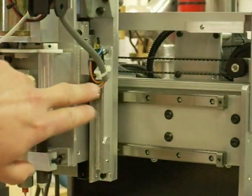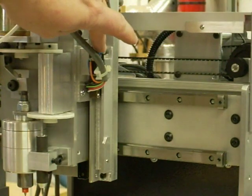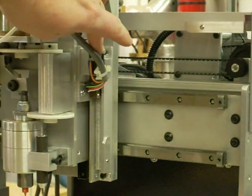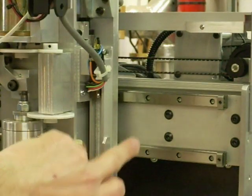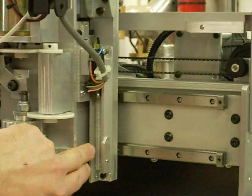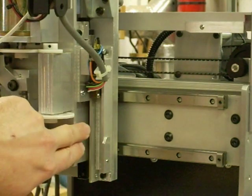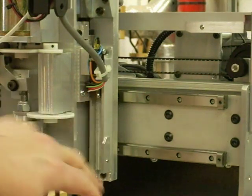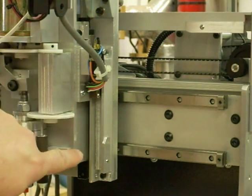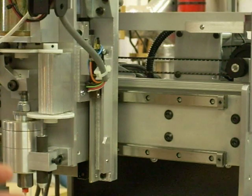Over here on the side of the Z-axis, you'll notice a cable coming in with a series of wires. What I've got is a small snap-acting limit switch with trip dogs on this aluminum housing back here. This aluminum housing also houses a linear encoder — a quadrature encoder-type scale, a linear scale. It's half-thousandths resolution, and this is the pickup head right here. All three axes have these linear scales on them. That assures me that I'm getting into the exact position that I want to be at and not relying on the stepper motors.